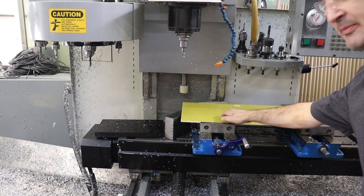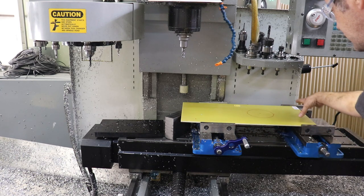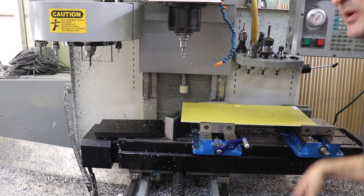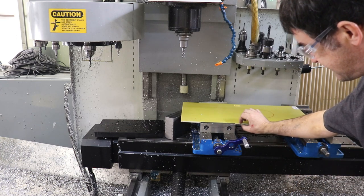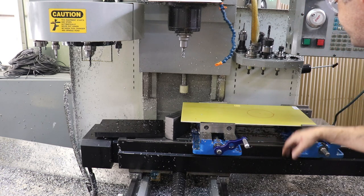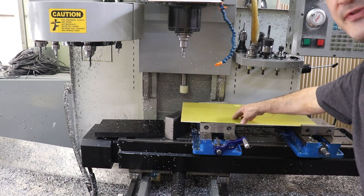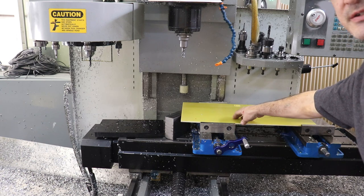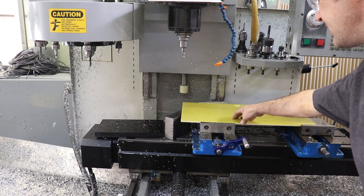So we need to make some thermal isolators for these new molds in the new molding machine. So this is 12 inch by 24 inch Garolite, which is 3/16 of an inch thick, or approximately 4.7 millimeters thick. And Garolite is basically circuit board material. It's just layers of fiberglass with epoxy resin, which is really high temperature and pretty strong, but not real friendly